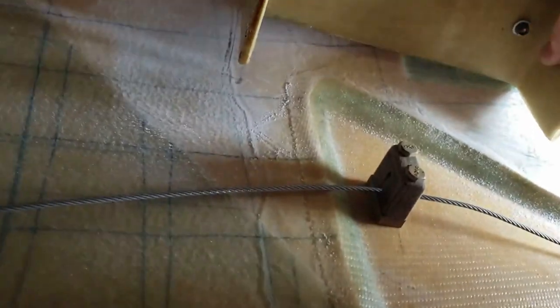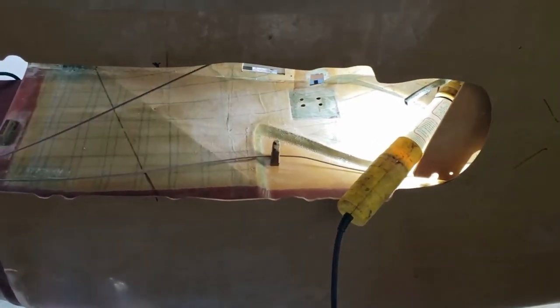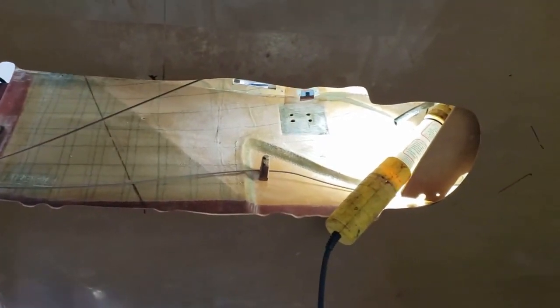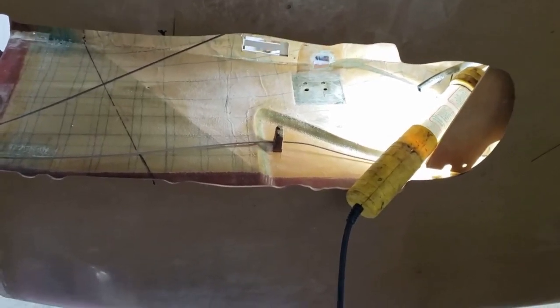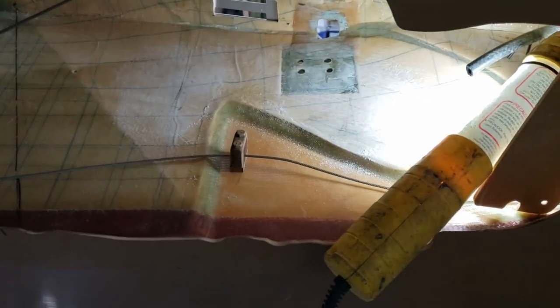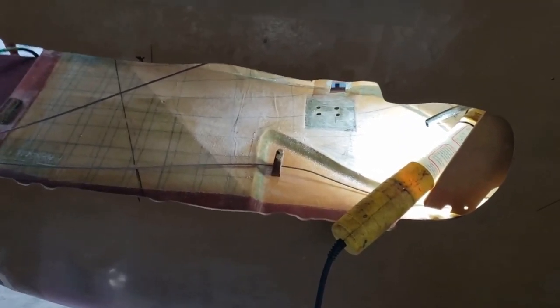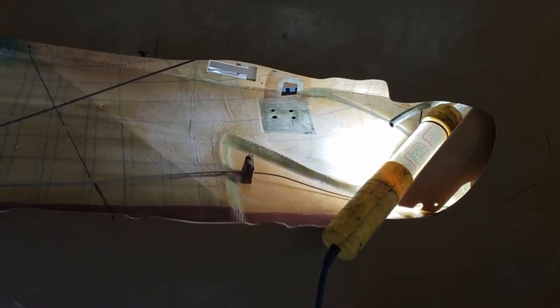Through this hole that I'm working in is the monowheel hole, and you can see it's kind of jagged because of all the pieces that went on the monowheel. But I've got to create a cover for that, and I'll also be putting in an access panel, so for maintenance or whatever, I'll be able to undo a square or rectangular hole to get this in and out of, so I want to keep that in mind. Always got to think of how you're going to get to something after you button it up. Otherwise, it's going to be a sad day if something breaks and you have to tear it apart to get to it.